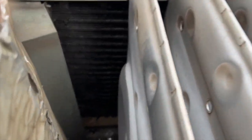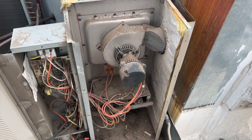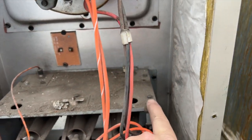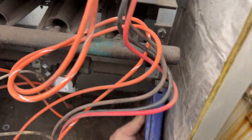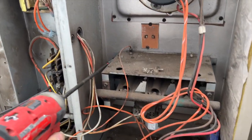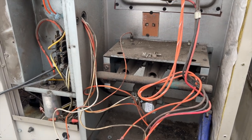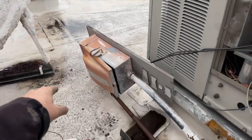It's already a thousand times better than when I first found it - you can see there. We'll get this whole area cleaned out and vacuumed. Got all the wires disconnected, got the gas disconnected. There are four screws here, 5/16ths each, and this whole burner assembly will come out. You're going to need an extension to do that - makes it a lot easier. The gasket's intact - I'm probably going to use high-temperature silicone to reseal that. Now we've got screws here on the sides.